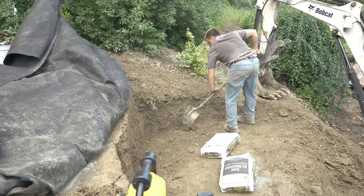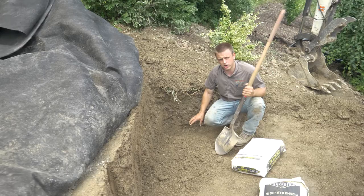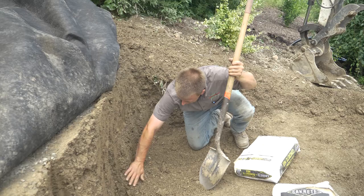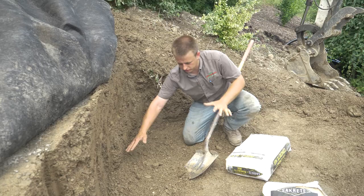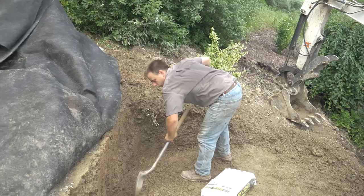I'm squaring out these corners here. This is what can make your life really hard when you're trying to build your waterfalls after the liner is in and all that. If these corners are kind of rounded up like that, your excavation isn't clean, and what'll happen is you'll have your liner flipped over and you're setting your boulder, and the corner of your boulder is going down right here, and it's hitting this first, and it just wants to kind of tilt your boulder forward. It just makes your life 10 million times easier squaring these corners up really good,